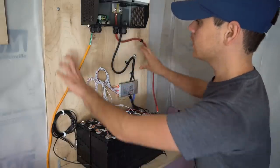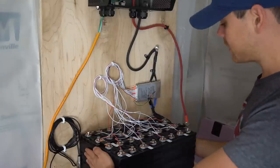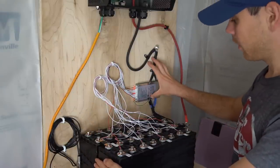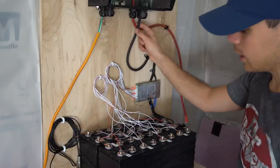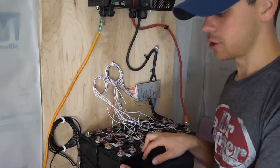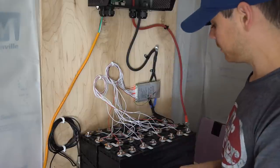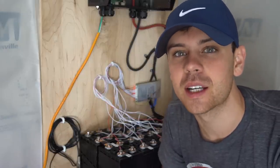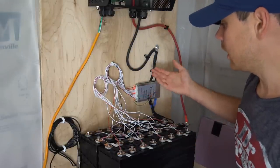To build the final system I connected the BMS to a maple plywood board on a shelf rated to 1,000 pounds using heavy duty L brackets. We have the battery, a fuse, the BMS attached to the board, the main negative and positive, balance leads, temperature sensor wires, and two wires going up to the MPP unit. It's a very easy to construct simple system. These are only 40 amp hour cells, but with 100 or 200 amp hour cells at 48 volts you could easily power a house. So far I really like it, though it was a pain to activate initially.